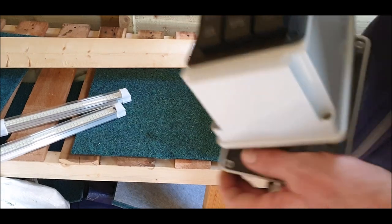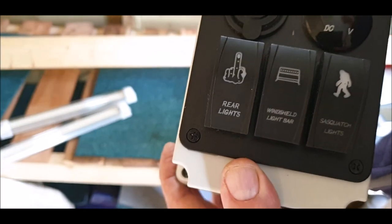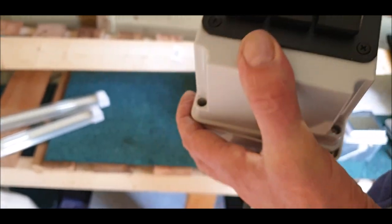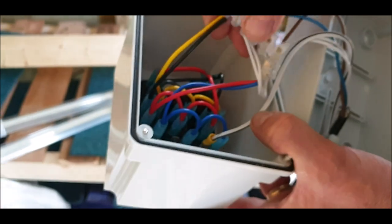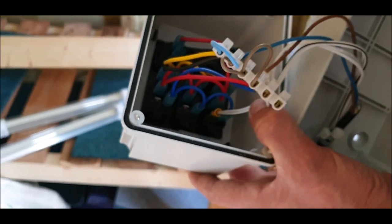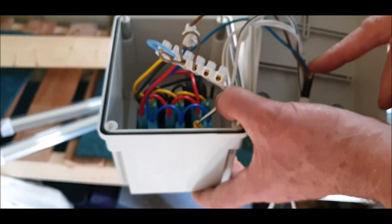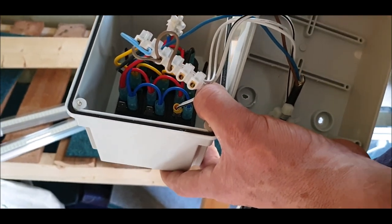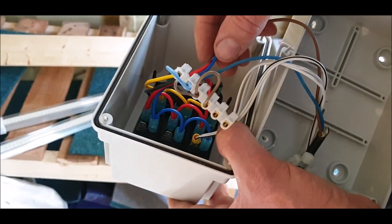This will make you giggle a little bit. You don't get the box with it — all you buy is the control switch. I don't know why they've done that. Real lights, you just got three switches anyway. To wire it up, if you look at it, you'll get an orange, a black, and a yellow wire, which is your LEDs — I'll show you in a second — and then you've got your mains, which is your switched and your live, which is your blue and your red. All I've done is got some old flex which I had laying around, three core.